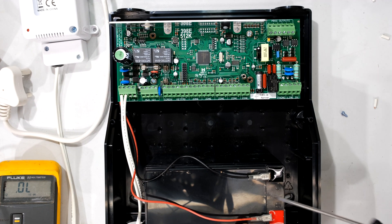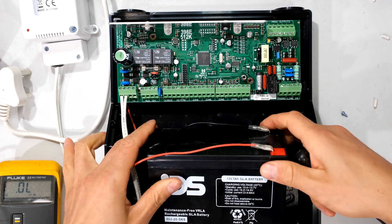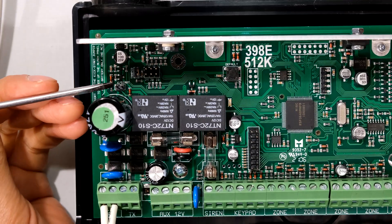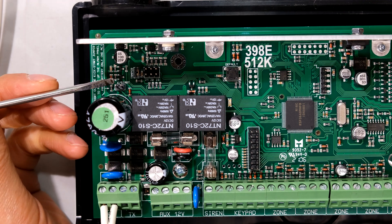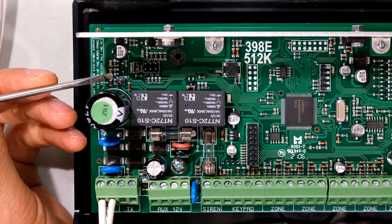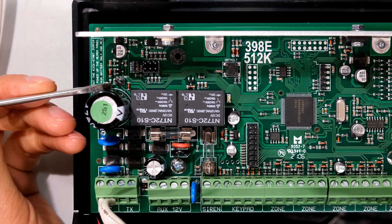What we do is we connect the battery — positive to positive, negative to negative. And all I need to do is use the kick start function on the main board. You'll see two terminals over here where my screwdriver is, and if I short them you can actually see it says K-slash-start — it says kick start. So what that's going to do is wake up the board, or power on the main board from the battery, while the power supply AC is disconnected.